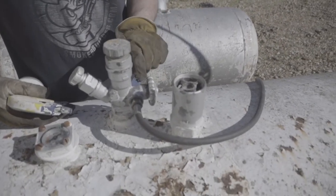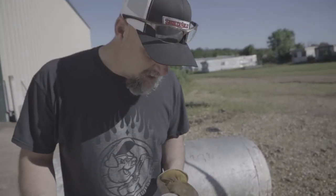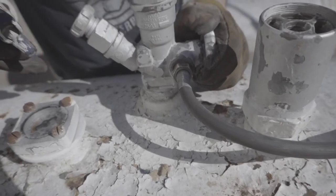Until I open this valve, more than likely what's going to happen is the valve packing - it's almost like a leathery rubber stuff inside the valve. The valve packing that's in this, when you loosen or tighten it after it's been in there a long time, it could leak. First off we're just going to open it and listen.